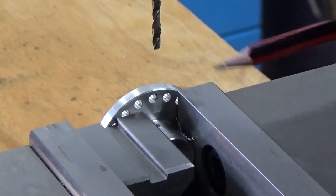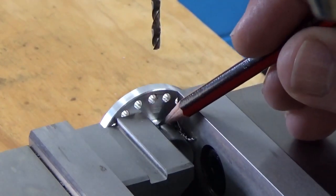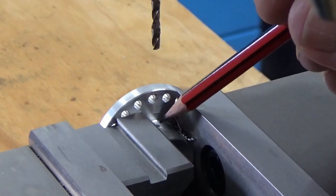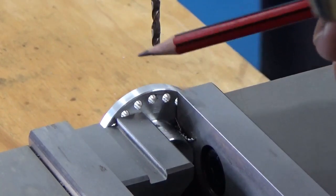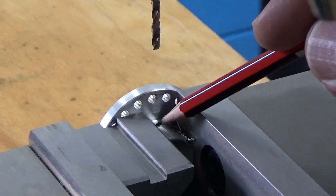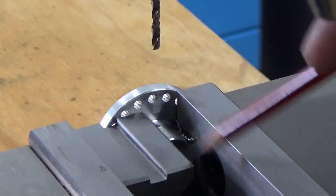What we're doing here is putting a through hole at that position — we're just on the spot drill. Now we're going to drill and tap for M4. The drill size we're using is a number 30. We're going to drill that all the way through and then tap from both sides.